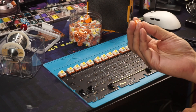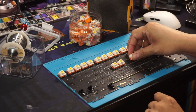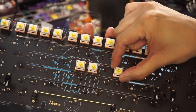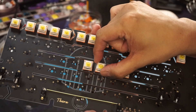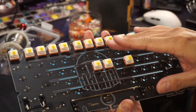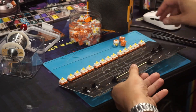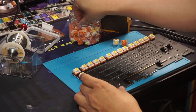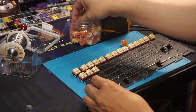This is a Sunset Gleam. HMX has really thin pins, so when you're soldering plateless, you'll see they are barely in the PCB and there's wiggle — see how they wiggle? Because even with five-pin alignment there's still rotational movement. So if you're soldering this plateless and you don't have Drop rails, you're going to end up with keys that are jank — some rotated left, some rotated right, you have crooked keys. Also, because they're so thin, the switches just fall out. You do it row by row — enough to do one rail's worth, which is maybe seven or eight switches.